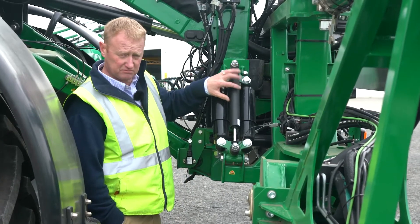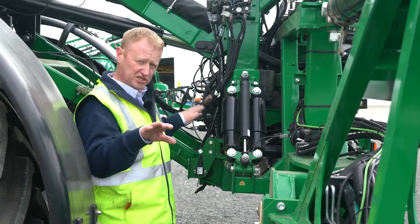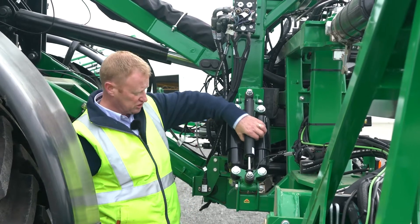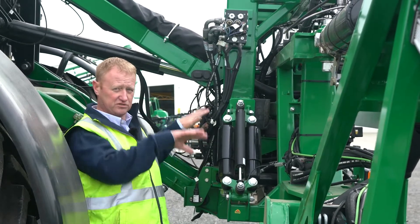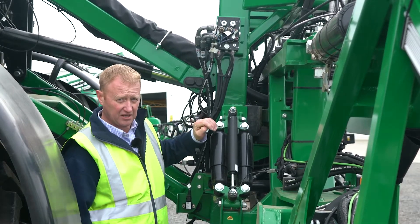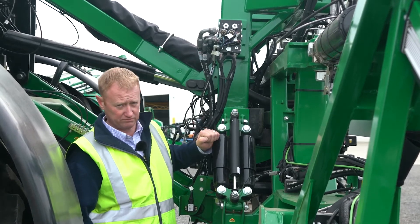The important part of this device is that when one wing wants to tilt up, the other side wants to go down. The whole system talks to this dampener via this cable, and it actually restricts the oil flow within this little shock absorber, which stops the center section from wanting to rock over. This controls the left wing going up and stops the right wing diving down, saving a lot of damage that happens out on the end — which was normal with the previous systems.